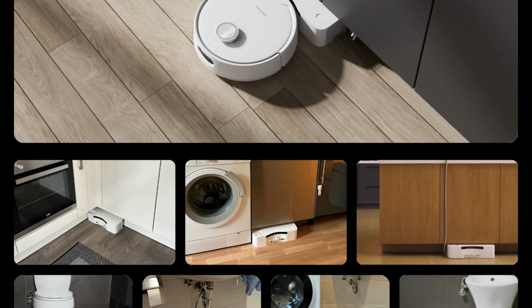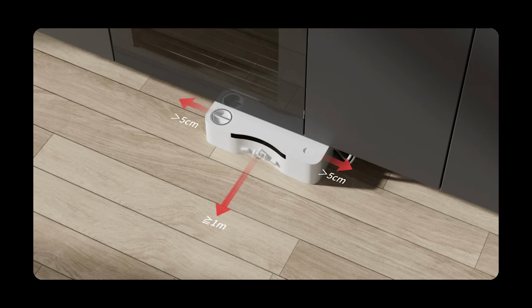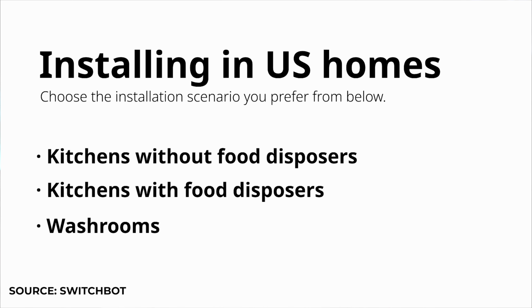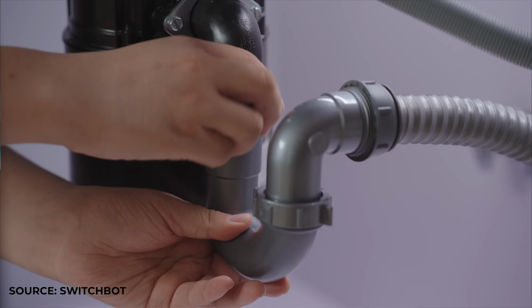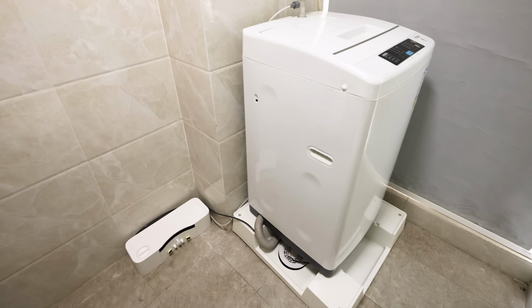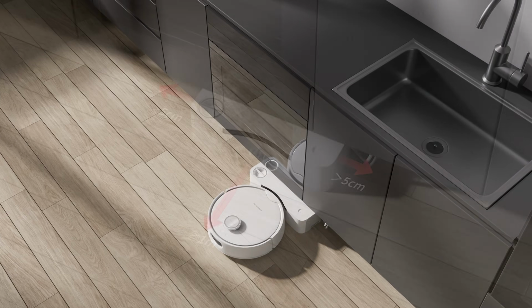Now again, you will have to have a good spot to install it. SwitchBot gives us very clear guidelines on what is required for the installation. They also provide some great installation guides in both text and video. All that is available on their website. I'll put links to everything down below in the description. And you can install the water station at your faucets, either with or without garbage disposals, dishwashers, washing machines, and even at your toilet. Again, just double check the installation requirements to make sure you have the proper space and plumbing required for this. Make sure you turn off the water at the location where you are installing this.